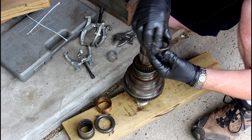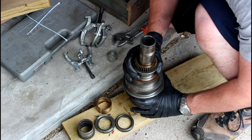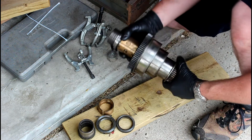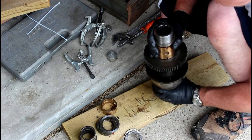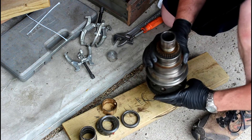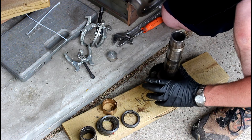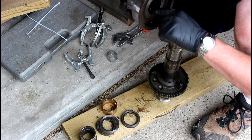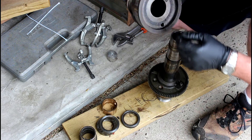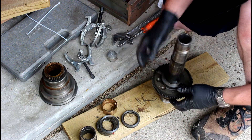These are all your bearings — good time to clean those guys out. With the spindle side down, this guy should just slide right off. Tap it and it should come off — don't lose your parts. So that slides off. Time to check this stuff — I got some grease and crap in there, so I'm going to double-check that and clean it probably before I put it back on. And then your bull gear — this one you can try tapping it off but these things are pressed on.